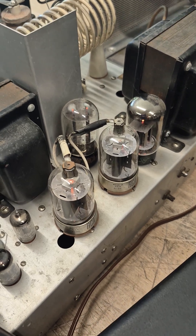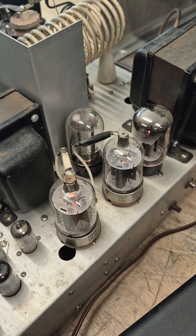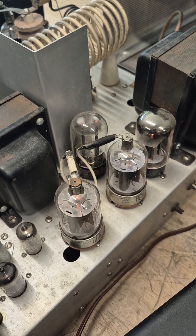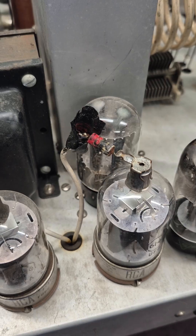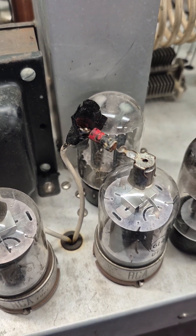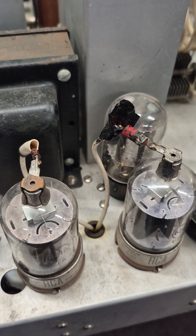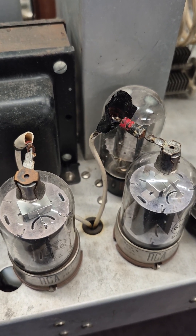While tuning up, I heard a noise and had some smoke coming out by the modulators, so I'm guessing we have an issue there. Let's take a look underneath. Well, I found the source of the smoke. This resistor here is supposed to be 22 ohms — it's open. We're going to have to investigate. More than likely we have a negative bias failure on the modulators.